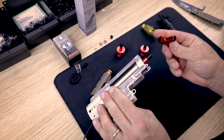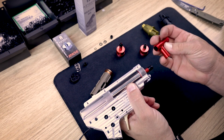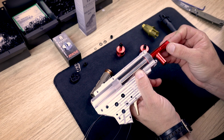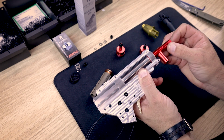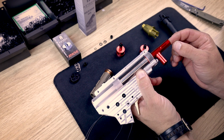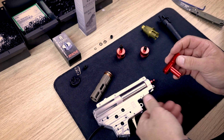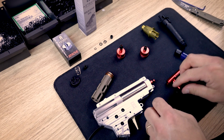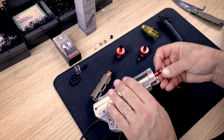Take the T-piece you are going to be using. This is the most common T-piece at the moment — an aluminium T-piece. As it slides over the top you can see it does hit the Apache before it bottoms out on the gearbox. At this point I have about one and a half to two millimeters of compression, which is too much. That's already got our nozzle stuck in there, so what we need to do is shorten our nozzle so that we have roughly half a millimeter of squish on our T-piece.